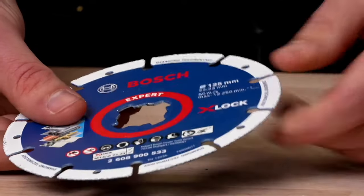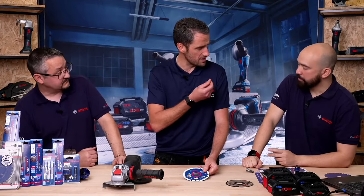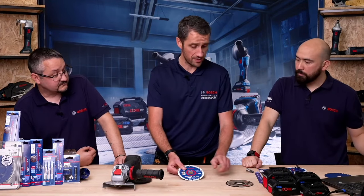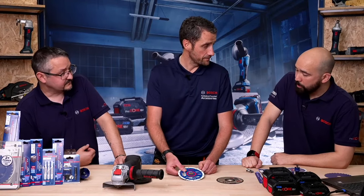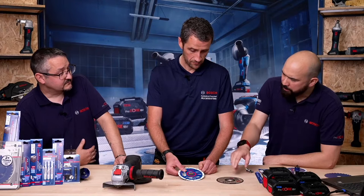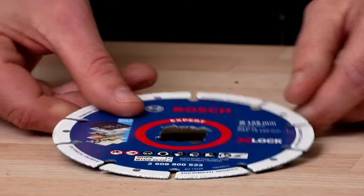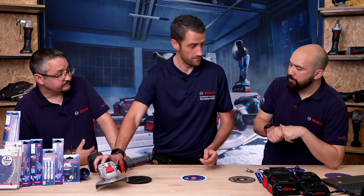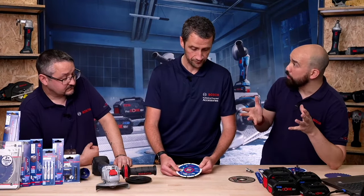If you do cutting only twice a year, you can get the diamond wheel out knowing there are no issues with sell-by dates. Also, it doesn't create any smoke — with a standard bonded disc you get that horrible sulphur-type smell, which isn't pleasant when working indoors, but this doesn't do that. The main advantage is that it lasts 100 times longer than a standard bonded disc. Yes, it's slightly more expensive upfront, but you'll save 10 times over the period of time. With a bonded disc the diameter decreases, so eventually you can't use the remainder and have to discard it before it's truly worn out. With the diamond wheel you maintain the same diameter all the way through until the diamonds are worn out — which is a long time away.